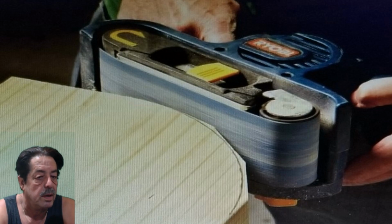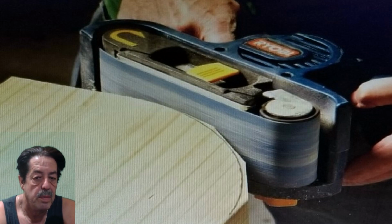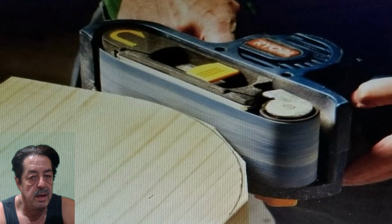Yeah, there is. Just like here in the picture, I got this off of the web, and this guy does it the same way I would do it. You make sure it's secured by using clamps on a table. Use your belt sander. Of course, you're going to cut it to that round arc the best you can. And when you only have this little bit left over, you can hold your belt sander on its side like this. Unless it's really bad, you can get away with 80 grit, or 120, depending on how close those lines are.